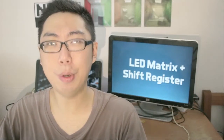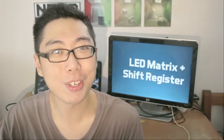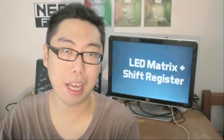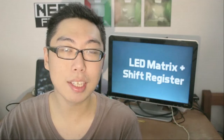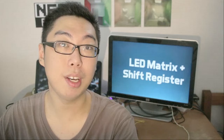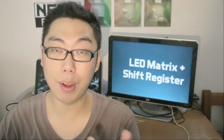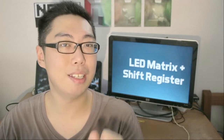Am I proud of myself for that solution? Yes, I am. Is it a great solution? I'm not quite sure - it's a little hacky but it does the job. What that means is at face value we have reduced our 16 wires down to just four: three to power our shift register, which we are still using, and just one to work with our decade counter.